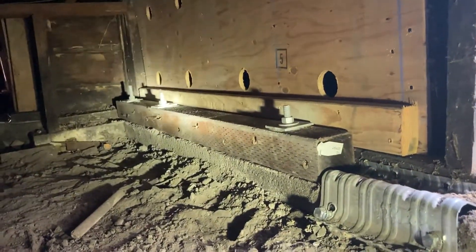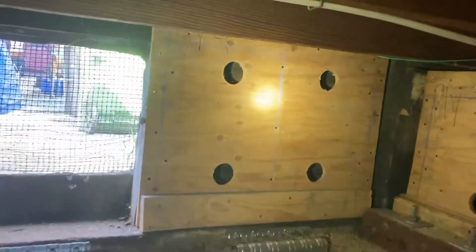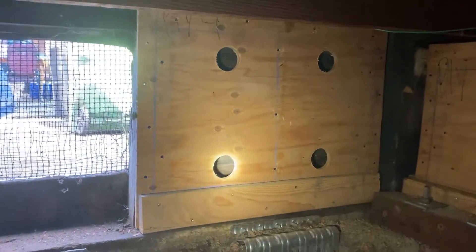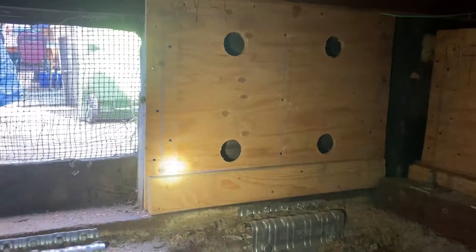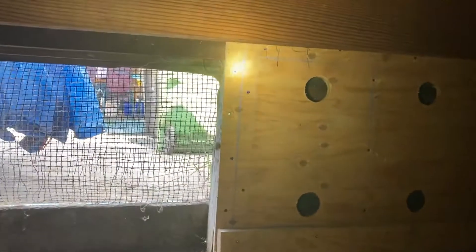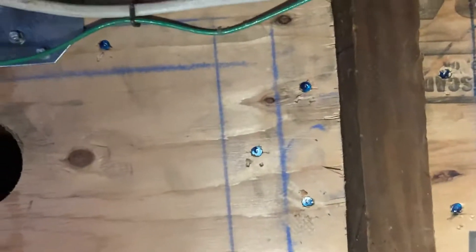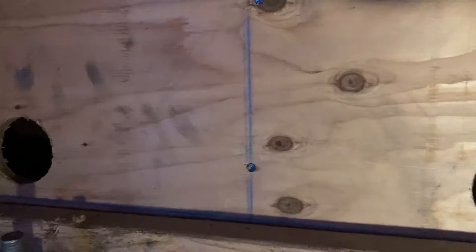And now the bracing — that's the plywood here that's been added, this piece right here. The holes are for ventilation so air doesn't get damp back there and cause fungus. Air comes in and out, and what they're doing is nailing the plywood to the face of these little studs here — all the blue and purple lines represent where the stud is, nailing it.